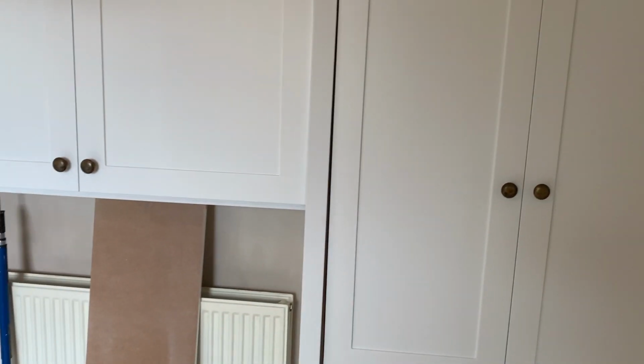So that's our method. Just dropping this bit in after watching that video back. What I didn't say is that one of the big reasons we use this method is that we moved away from trimming doors to fit within a frame. So our alcove units used to be traditionally made, we'd make a rigid jointed face frame and the doors would be fitted within that prior to painting. What we do now is we make the doors to a precise size and as square as possible, very square these days because we get them CNC manufactured.